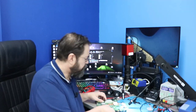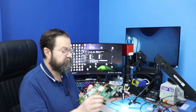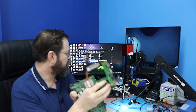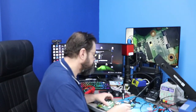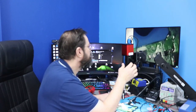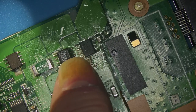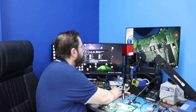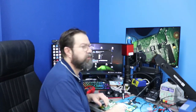Today I want to talk to you about the first MOSFET. Your first MOSFET is right off the DC jack, and on this particular board that's located right here. We'll see it under the microscope. So your first two MOSFETs are located right here — that's the first one and here's the second one. We're going to talk about the purpose of it, because there are some people that feel that this first MOSFET is optional, and it is not.